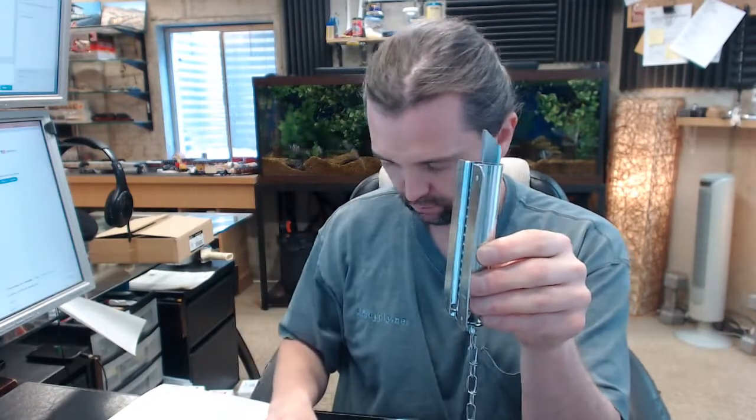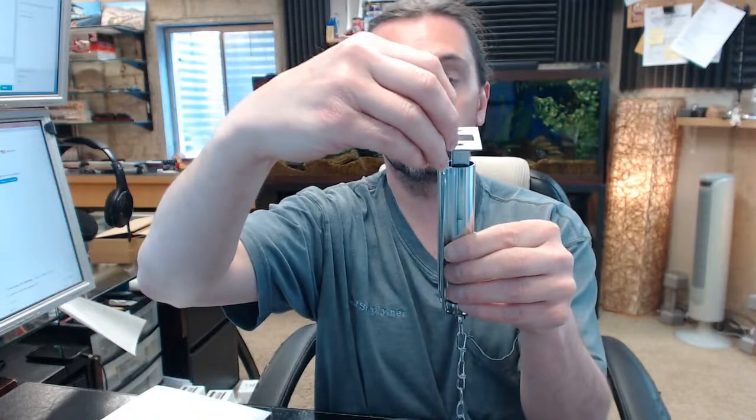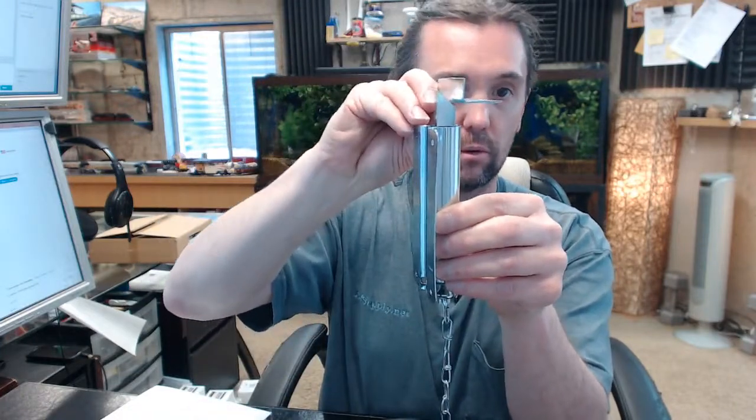All right. Now, for an out-swinging application, you're going to be standing on the push side of the door, and then obviously you need to reverse this. So I'm just going to reverse it back around. You can see that that doesn't take but a second to do. So now we are on an out-swinging application. You're going to need to make sure that you've got this angle strike installed. The door is here and it's going to swing out this way. You're going to want to make sure that you get this installed like this, so that it's properly installed like this. So this is really going to go on the rabbet of the frame, or the stop, not the rabbet, forgive me.